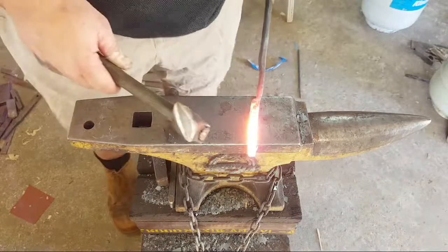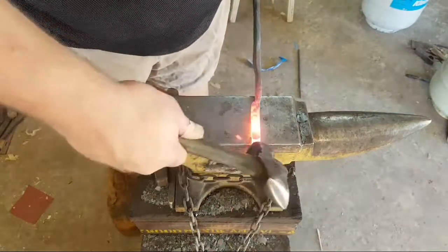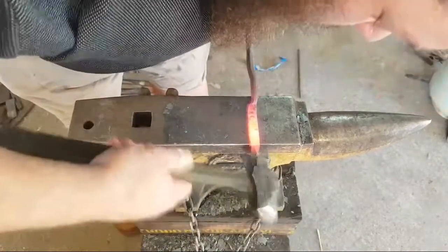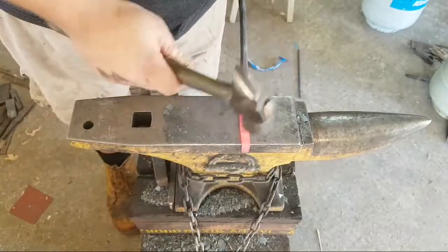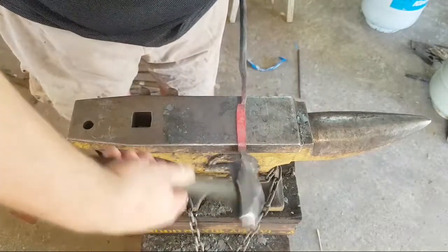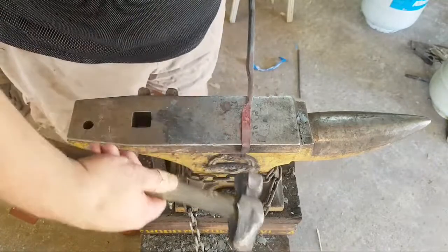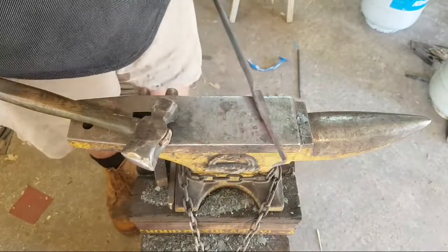Hope you're enjoying it. Okay, so I'm going to select about an inch and a bit, inch and an eighth, and I want to make it 90, like a hard 90. It's not going to have a hard corner on it because I didn't leave a lot of material. There you go. About a hard 90. And that's going to then get curled into the nib.